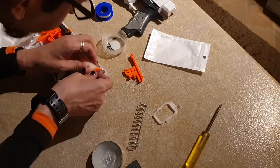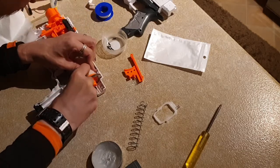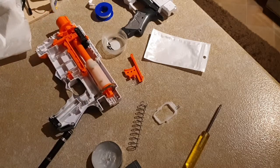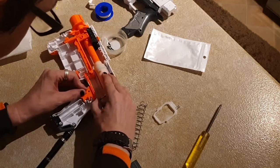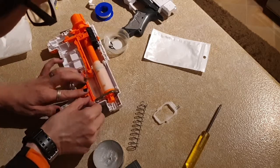So if we slide the catch spring over — the catch spring does not like staying, so give it a nudge. That to me looks fine. I don't know if anybody else can see any issues but I certainly can't. Dropping the trigger — and that should interface nicely with the catch, which I will say is incredibly tight. I'm not kidding, that is one hefty little spring.